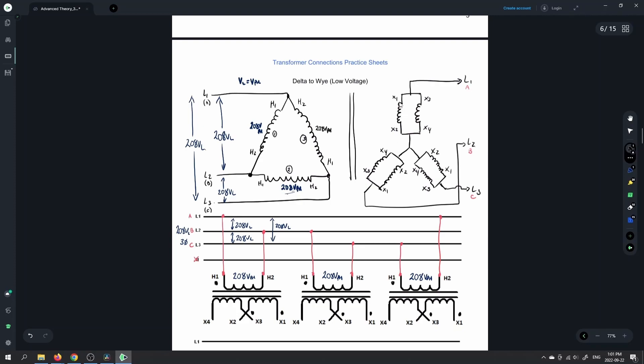I may have mixed up the placement of right or left on this parallel circuit, but essentially we have the same polarities on each of them, so we should be good to go. When I put 208 volts to the primary, I'm going to have 120 volts on the secondary. Because the ratio of this transformer has not changed — the ratio is 1.73 to 1 — with the number of turns on the primary versus the number of turns on the secondary. So the voltage from a line to a neutral point — this point right here would be brought out to the neutral — and oftentimes that is bonded to ground, so this voltage would be 120 volts.